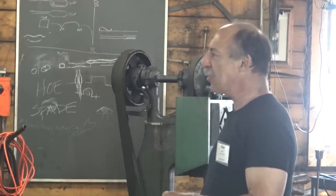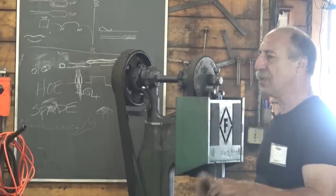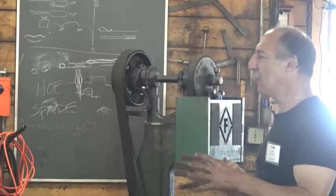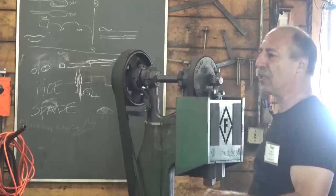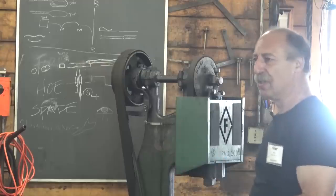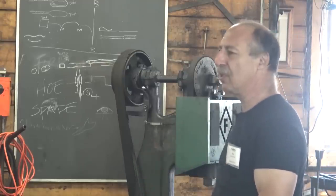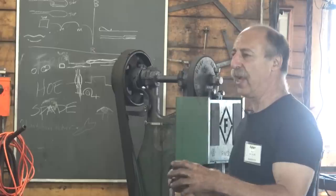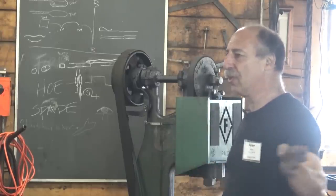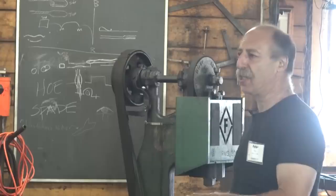And then the best way of making the steel homogeneous back then was to take the original blister steel, put it in a crucible and remelt it, and not add or subtract anything, just melt it. And then you have a homogeneous mix of whatever was in there to start with. And then you get an ingot from that melt, which you would forge into a bar. And that was called cast steel.